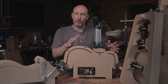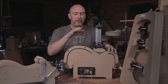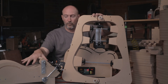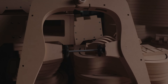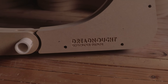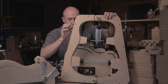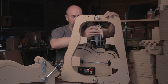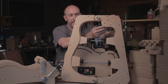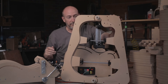I want to show off a couple of other products that are going to go hand in glove with this machine. The first thing is our outside forms — the outside molds are going to be available for all four of the forms we're selling for the side bender: the dreadnought, the OM, the grand auditorium, and the Robert O'Brien classical guitar. Each will come with a set of spreaders. One of the unique things about these outside molds is they'll all have the ability to accept the cutaway form using a tab and a steel pin. If you want to do a non-cutaway version, it'll be the same mold — just pop that piece in for the cutaway version.